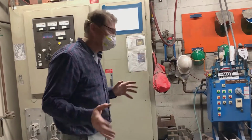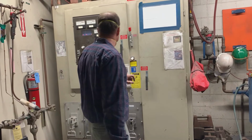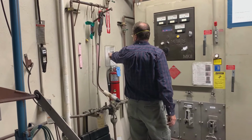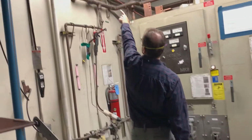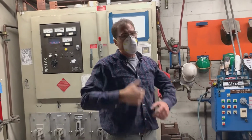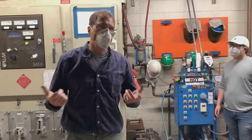Maybe you're not that fussy, but there is a procedure right here for the emergency cooling system. It says close the 2 yellow valves. Look for yellow right up there. Those go out to the radiator, all the water in the radiator. That way we don't have as much dilution to do at the end to get back up to running, okay?